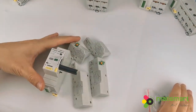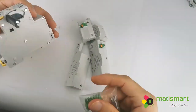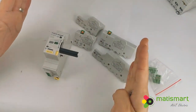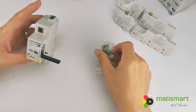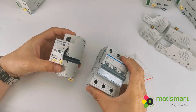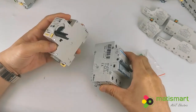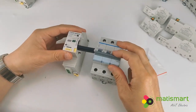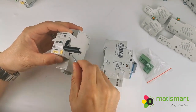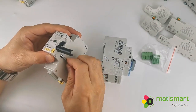We can supply it either way. When you receive this device, you can choose whichever option suits your warehouse and stock needs. This applies to one, two, three, and four-pole devices. When installing the breaker with our device MT84SR together, we must be careful that both handles are in the off position. This is the part that reads the current fault — it is mechanically connected.